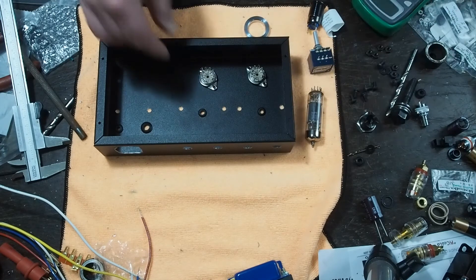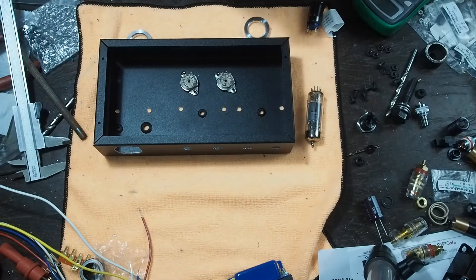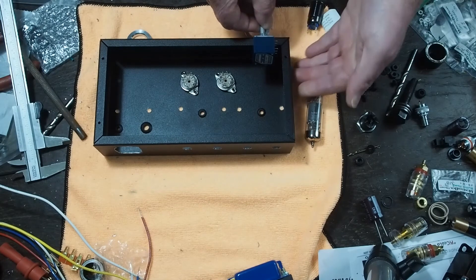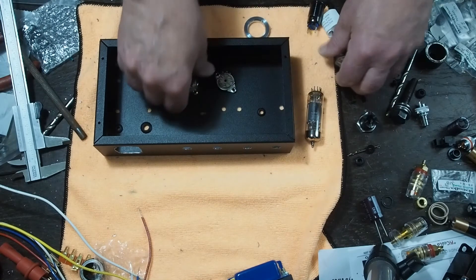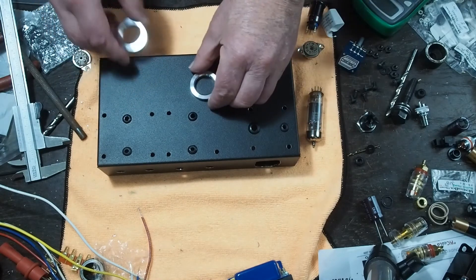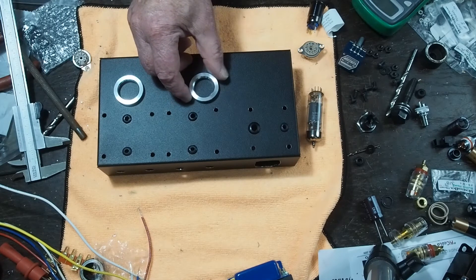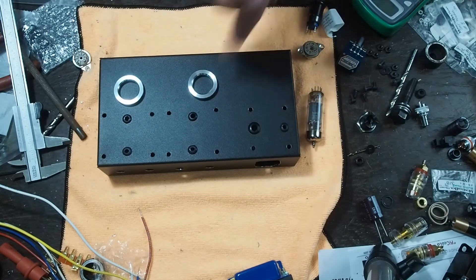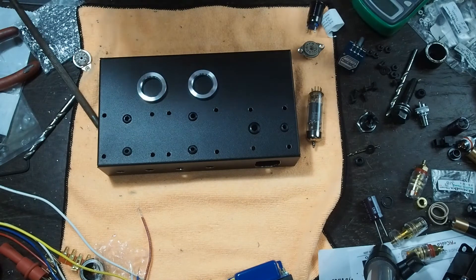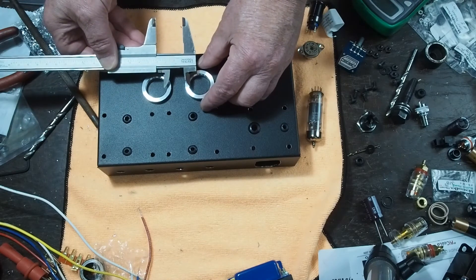So I started thinking: what if we shift the tube sockets over there and put the potentiometer down here on this end and have the RCA jacks here on the side? We're only having to shift this tube over just a little bit — about right there — because we still want to keep this tube away from where the AC filtering is being done. This tube would have to get shifted over, and if we get 30 millimeters, we can move this tube over to about like that.